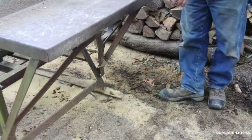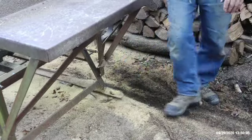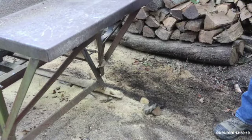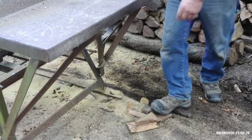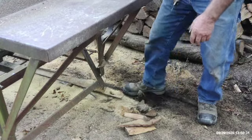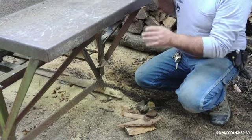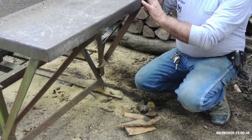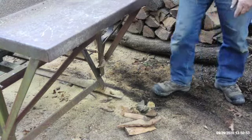Another thing, if you've watched any number of my buzzsaw videos, you'll see many, many times, while I'm going to get another piece of wood, you'll see me kick back and forth like this, kind of clear the area. There's a reason for that, simply because of all the little pieces that get cut off, little short stubs that just fall down there. If you leave all that debris down there while you're working and stepping back and forth, all it takes is just a wrong step on the right piece, and you lose your balance, your feet will slip out from under you, and you'll grab, without even thinking about it, onto something, and that could create an issue because you could get your hand in the blade very, very easily. So you will see me during the course of the videos just kicking the debris and the sawdust away.